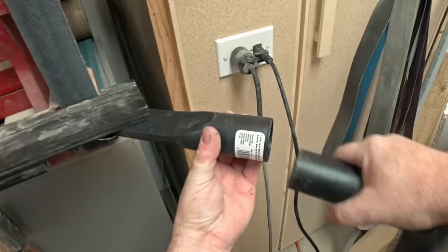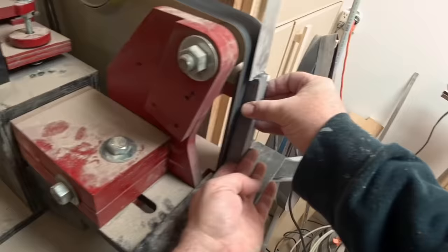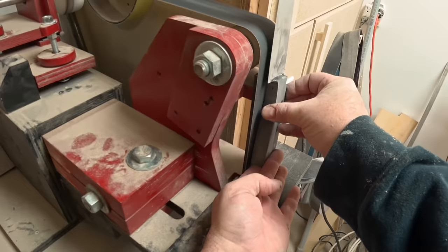All right, it was going reasonably well with the grinder and the flap disc. It didn't have any problem whatsoever grinding down the grout, but it was getting a little bit gummed up on the copper pins, so I'd be grinding deeper around those. And not to mention that my hands are freezing cold at this time with the fan from the grinder blowing right up my sleeve. So I decided to bring it inside and finish the shaping on my belt grinder.